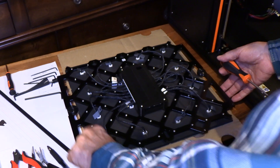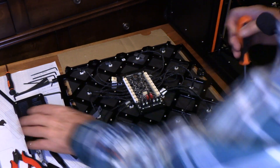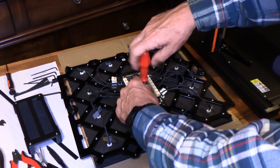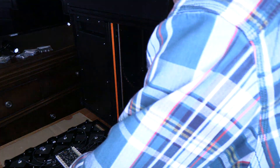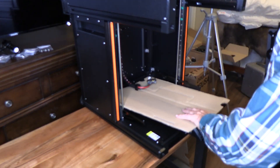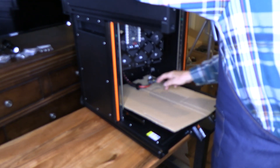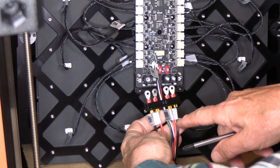Next, take the heat bed with the little notches to the left, put some cardboard underneath it, then unscrew the four T10 screws and lift the cover off. We're going to connect four connections using a Phillips screwdriver to the umbilical cord coming out of the back of the printer. Carefully lift up the heat bed, put a little cardboard underneath, and get that umbilical cord. You want to position this so the connections are down.